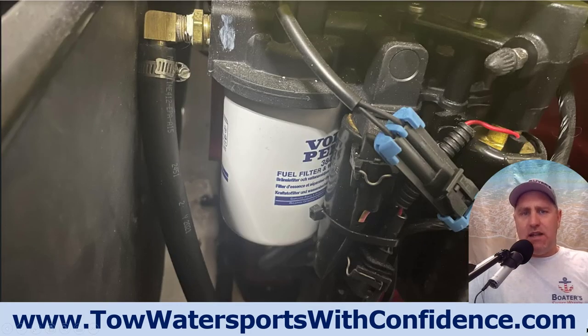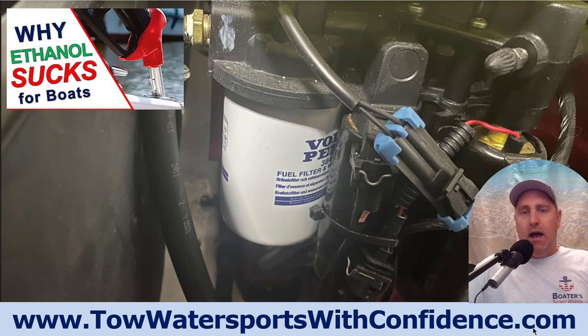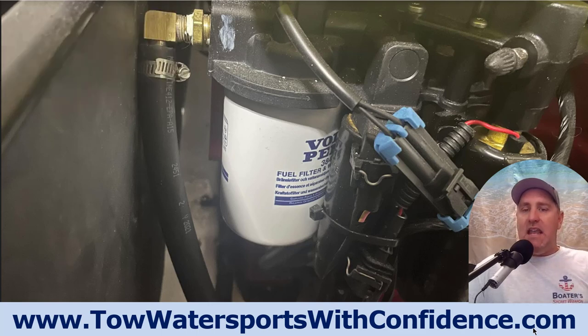Now, this looks like it could be an oil filter, but it's actually the fuel water separator or fuel filter. You're seeing these on boats these days because of the proliferation of ethanol, and because the open fuel system that we talk about can suck in moisture. I've got a whole video on why ethanol is not very good for boats. And these fuel water separators are a key component to keeping your engine running good, making sure that water isn't getting into the fuel system.